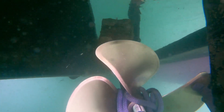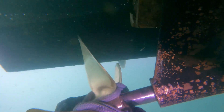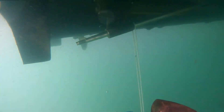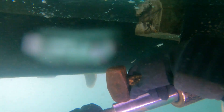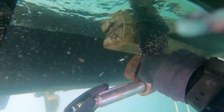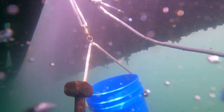With the new prop, slide it onto the shaft and see how far up it goes without a key installed. Make a small mark — a grease pencil works great, but I used a knife to put a small scratch. Put the prop back up on the shaft, grab the new key, and grab the sledgehammer. Get the key tapped in and seated properly. You may have to tap it in the keyway and adjust it — you don't want it going too far. In this case we went a little too far and just tapped it back into place. All good, secure, and ready.